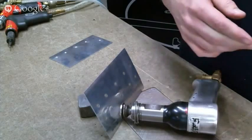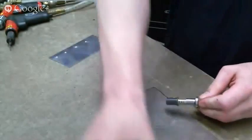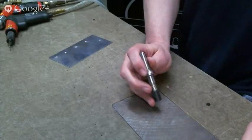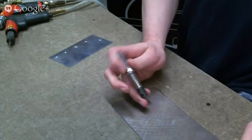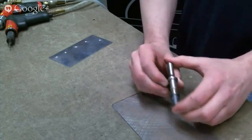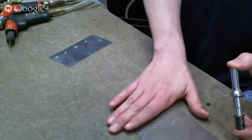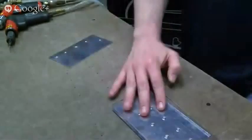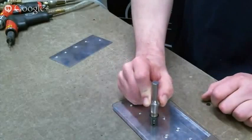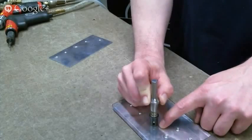That leads me into the back rivet sets. A lot of the stuff on an airplane, you can back rivet. And so all of the control surfaces you can back rivet, and then you can even back rivet a lot of the fuselage skins and wing skins and stuff. So what the back rivet set does is you can put the back rivet plate on the table, you can lay your work down onto it, you put the set over the top, and it pushes the two skins together while it's setting that rivet. So you have nice tight skins, there's no air gap in between.